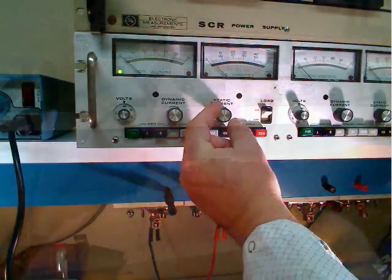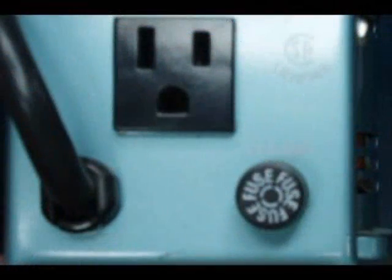You may have noticed that there is no replaceable fuse on the power supply. Fuses are no longer used as current limit protection for modern power supplies; they are now only used for what is called catastrophic failure. If you have a unit with a blown fuse, it means the power supply was damaged or is defective. I recommend returning it to the manufacturer for repair or replacement.